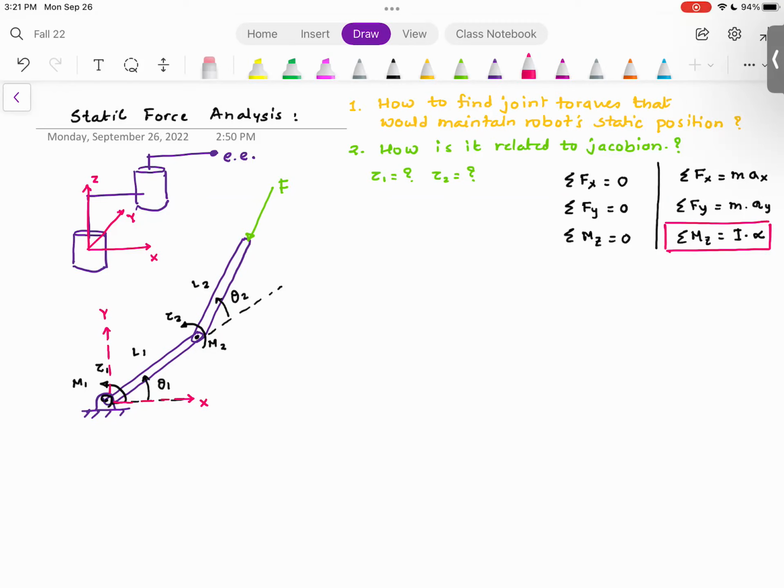How do I supply these torque values? These torque values get supplied to the motor by means of the motor controller. And depending upon your controller architecture, whether the controller is analog or whether controller is digital, you can change the torque values or the torque that the motor is supplying, and then actually achieve the desired motion from point A to point B. But remember, that motion is very, very slow. Everyone understood this? So this is the first level approximation that you can use if you want to build or design the robot.